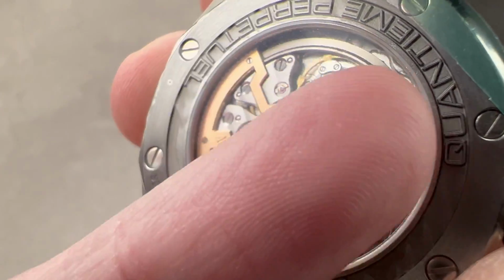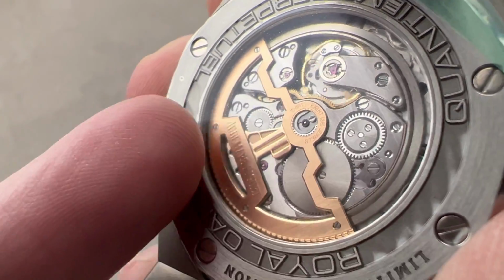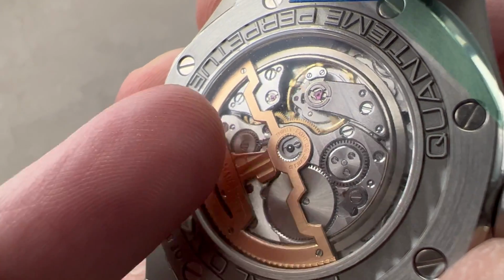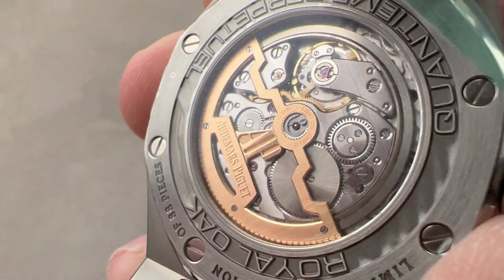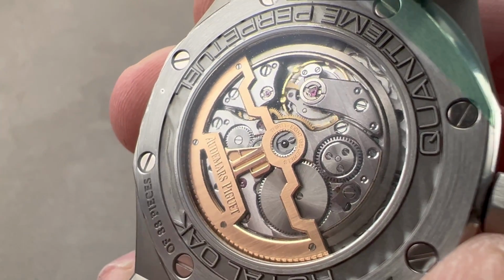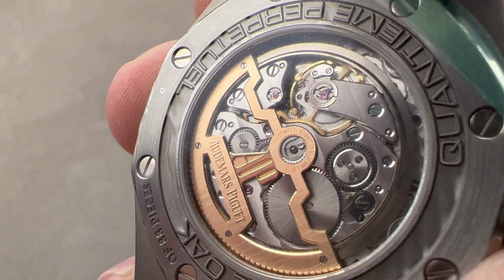Now, it features a beryllium ring all the way around. You can see it. The rotor goes all the way around. There's a mass on one side, and the result is that the rotor itself and then the mass can be sunken very close to the bridges and the plates, but by putting 4 ruby roller bearings, one at each corner, the beryllium ring and the mass cannot actually contact the plates or the bridges.